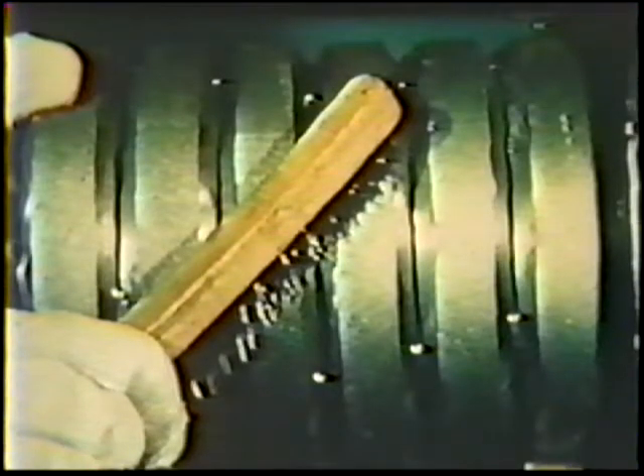The workpiece for this exercise is the same as the one used in topic number 11 and is composed of six pipe rings forming five weld joints. The tack welds and joint edges should be thoroughly wire brushed to remove contaminants. Secure the workpiece in the 2G position. The pipe is located vertically and is fixed to prevent rotation. This pipe position simulates horizontal plate welding.